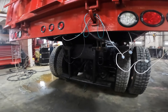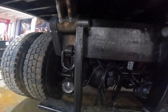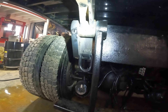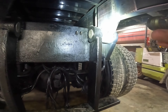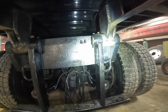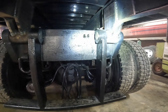We have our tail hinge all welded into place. I ended up drilling a couple holes in these tubes to put a grease fitting in. I jammed a quarter-inch bolt in there just so the threads wouldn't get bunged up with any weld - there's a little quarter-inch bolt right here. Everything's still kind of warm, so once that cools down we'll get a grease fitting in there. We've got to get some primer on that and some paint on there.